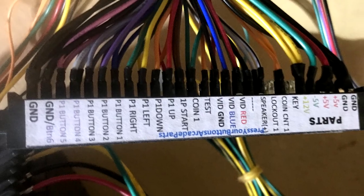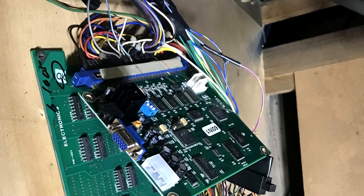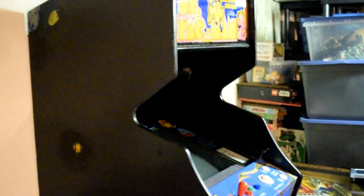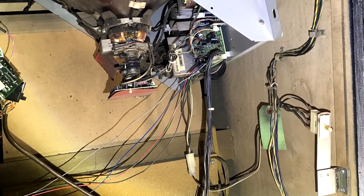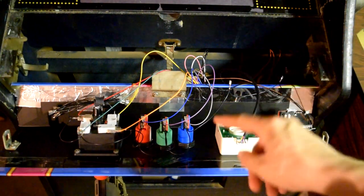If you already have a JAMA cabinet, setup should not be too terribly complicated. Some multi-arcade boards require that you disable certain ground leads or disconnect a power lead for full functionality — not the 60-in-1 IKJAMA PCB. Just plug it right into the JAMA harness and you're good to go. If you're retrofitting a cabinet, things can be slightly more challenging. I use an old Super Pac-Man cabinet that was Frankenstein'd to play a bootleg Ms. Pac-Man JAMA board; the monitor wires had to be modified and the speaker wires needed connectors for the JAMA leads.